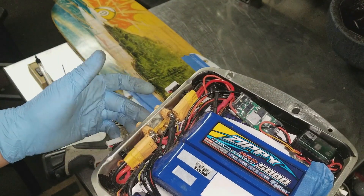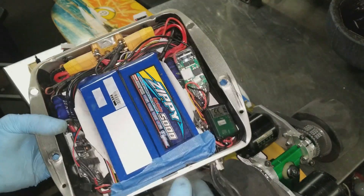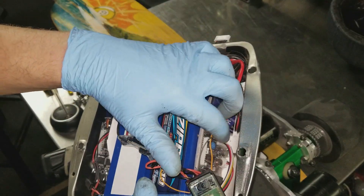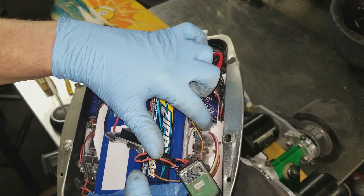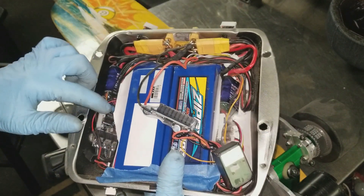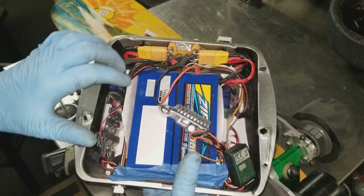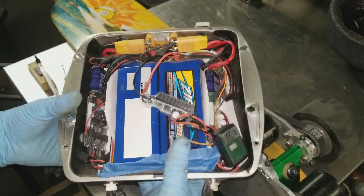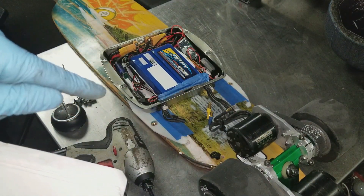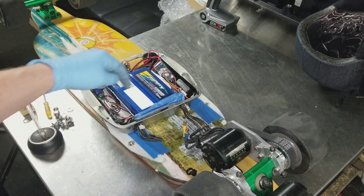The sensor lead cables that came with the VESCs match up directly to the Torque Boards motors, so that connection's done. You can run these individually on two different channels, or you can run one as a master and one as a slave. To do that you need to buy a JST connector — the terminal type is a mini JST 2.0 PH. That way you only have to hook up the receiver to one VESC and it sends commands to the secondary VESC.